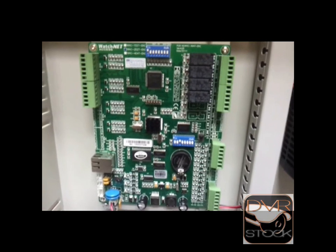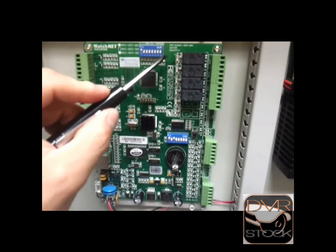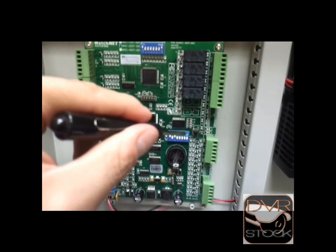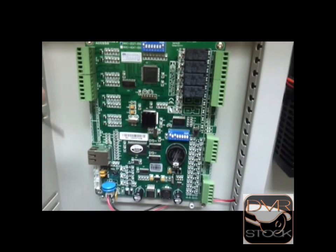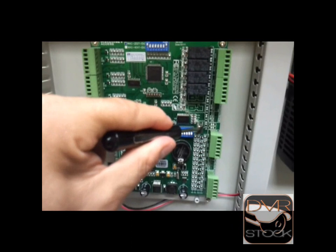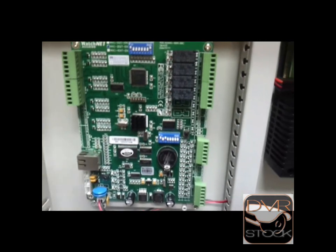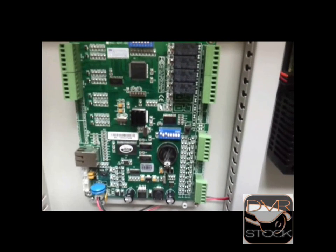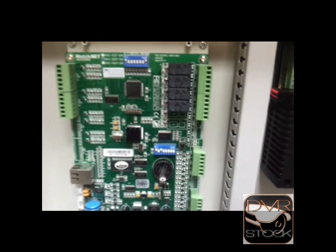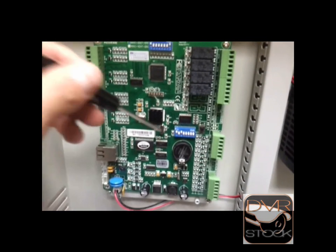Right now I'm going to leave it on. We have DIP switch 8 — when we put it up, power OFF and ON. We have this RESET button, which has to be unplugged from any communication source. We press this RESET button for 10 seconds or more — 10 to 12 seconds is enough to delete all the memory inside the panel. In case we were making tests in our labs and then placing it on the customer's side, we don't want that information to go there. So we delete all the information inside the memory. Once we're done, we power off, take the DIP switch down, and power back ON.